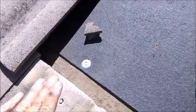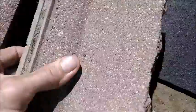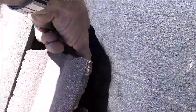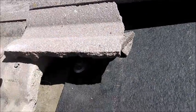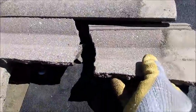Here's a quick tip on how to support a broken tile right in the middle of the break. I've got a couple of pieces - I'm going to glue these together and put them underneath the middle of the break. I'm going to put this tile in like this and glue this one in place. These two pieces glued together and glued underneath will support the break. The problem with cracked tile is that you often have no way to support the break when you glue it together and when you flash it.